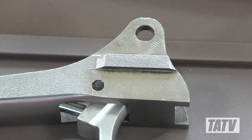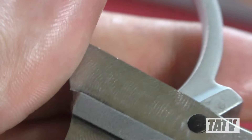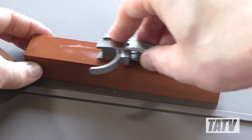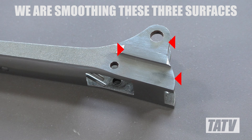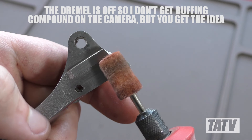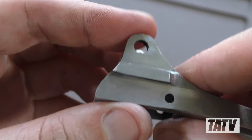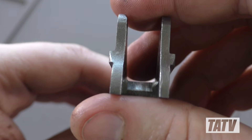With the new spring installed, it's time to take a second look at the lower tang. The finish on this part is just abysmal. As mine's at least a few thousandths of an inch too large to fit the receiver properly, I've opted to use medium and fine India stones with some honing oil to take it down. It's important to note we're not applying much pressure — the name of the game is to remove the excess material and smooth the surface while maintaining the original angle of the part. We'll finish up by using a Dremel tool with a felt bit and some jeweler's rouge to further polish the mating surfaces to a shine, giving us a tang that's smooth, polished, and straight.